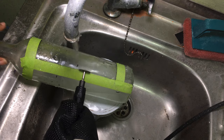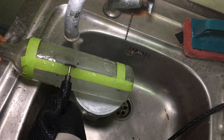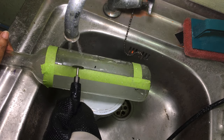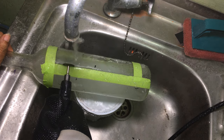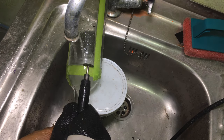Gently apply pressure downward until the shank in the cutting disc rests on the tape. Slowly move the tool forward to cut the glass. In real time it took 90 seconds to cut the side. Cut along the remaining lines until the glass drops out.